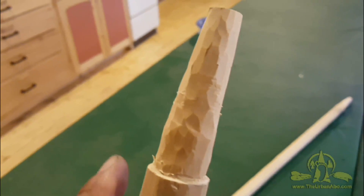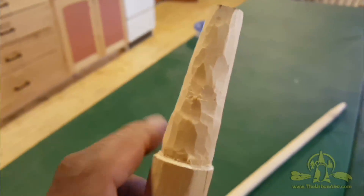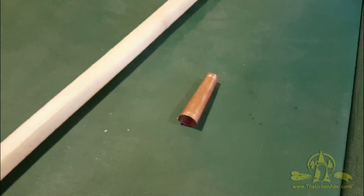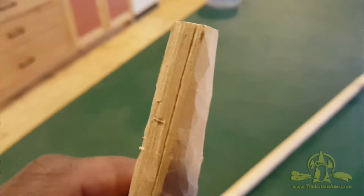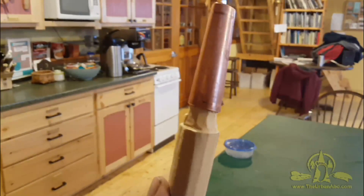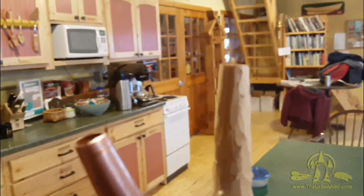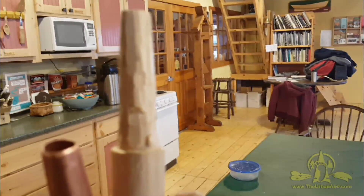We're going to fit the copper caps on. As you can see, I've already tried to fit the caps on — the high spots, the dark areas that you see, are what I want to whittle away to make sure there's a snug fit. So I fit a little bit on and then whittle a little bit off, fit some on and then whittle off. The dark areas are the hard spots I want to whittle away, and I want this to fit on here all the way fairly easily. Then we want to put some clamp rings on it and hammer it tight.